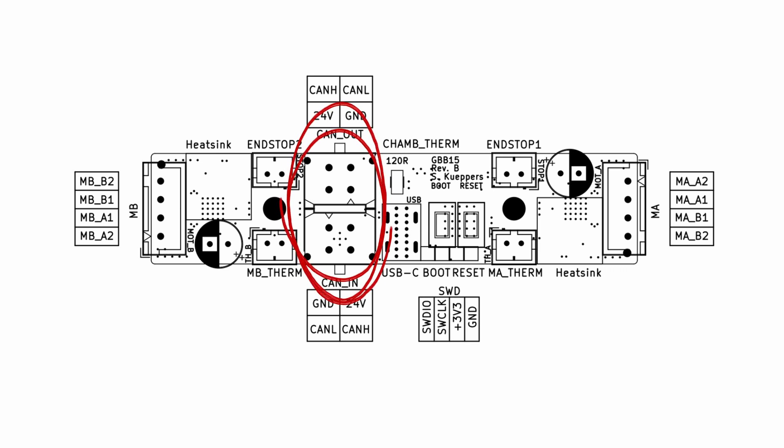On the board, you get a CAN in as well as a CAN out. There's a USB-C port, which is used for flashing as well as putting this into a USB-to-CAN bridge mode. For example, you could mount this on a fixed gantry printer like a V0 or Salad Fork, run power and USB to it, and then come out of the CAN output to go to your toolhead.